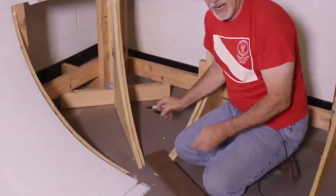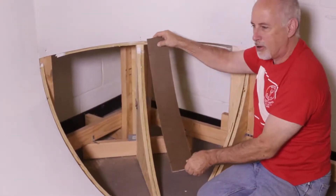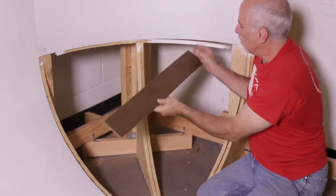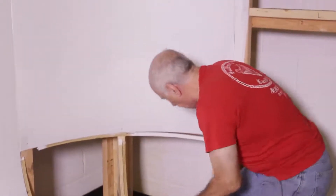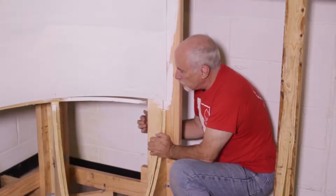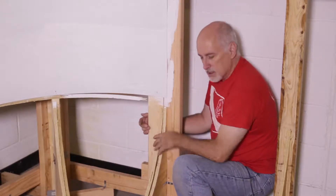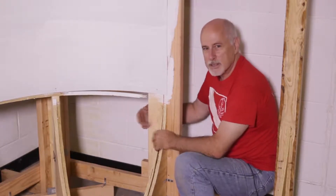What makes this hard is you have a compound flex to deal with — a flex in one direction and a flex in another. That makes it hard to get one piece of material to flex in both directions, because the piece would have to actually shrink in size. By coming down a step at a time and cutting these as wedge shapes and putting them in, we can fill the hole pretty evenly. We've left a panel out and we step behind to apply gaffer's tape between the different levels — that gives us something to mud against and closes the back of the gap, otherwise your mud just keeps dumping out the back of the crack.